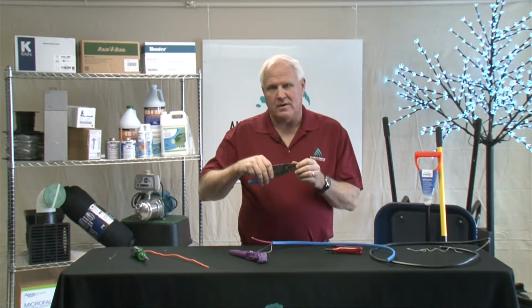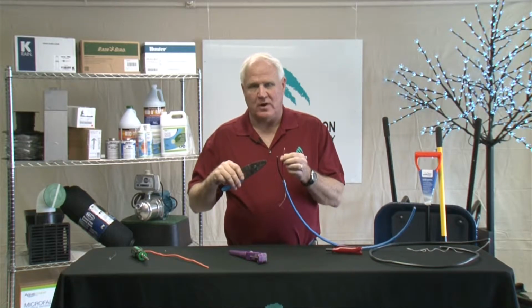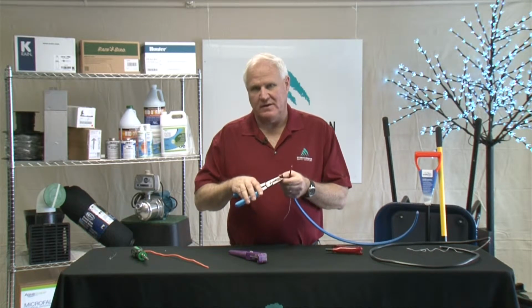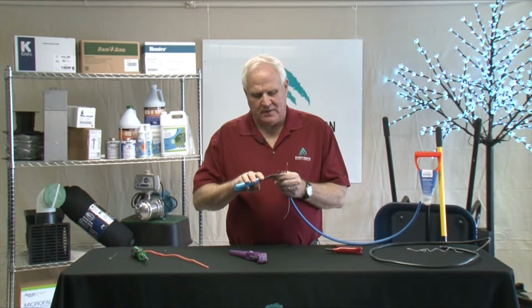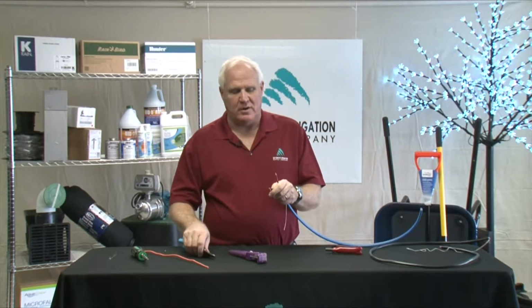But on your wire cutters, they're numbered for the gauge of the wire. You want to know the gauge of your wire, which this happens to be 14 gauge, and I'm going to pick the gap that says 14, or I can pick the gap that says 12. And I'll tell you in a moment why I would do that. And what I'm going to do is just simply pick the 12 one and pull it off.